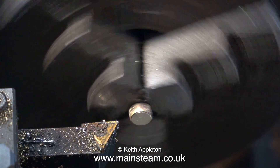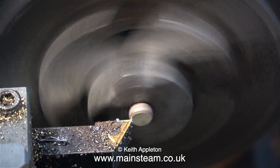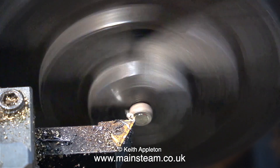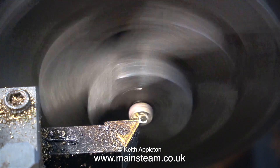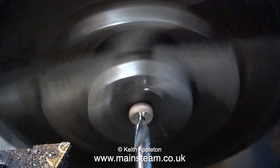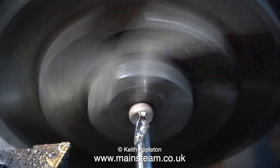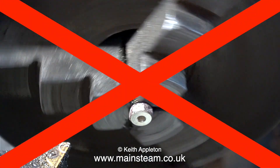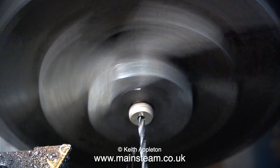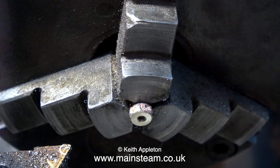I don't know whether the silver solder is any better or worse a bearing surface than brass. Brass wears out very quickly — it doesn't seem to in small oscillating cylinder engines, but then again they don't have much pressure put on them. One more cut should do it I think, and the end of the brass nut is flat. The first thing to do is to drill a center hole down the work, and obviously I'm using a center drill that is smaller than 3/32 of an inch. Even though the center drill went down the center of the work, when I use a twist drill it's a different story — you can see it wobbling about.